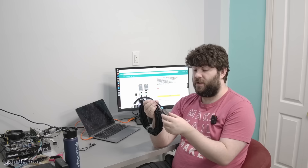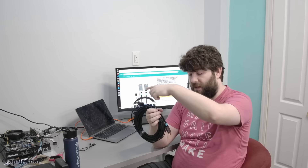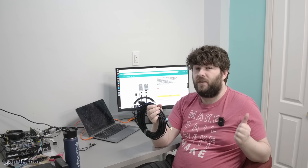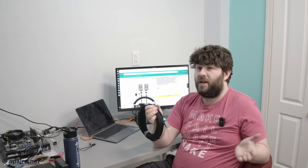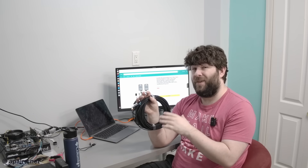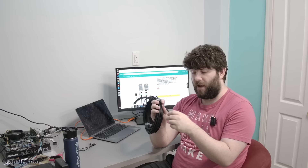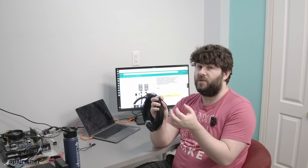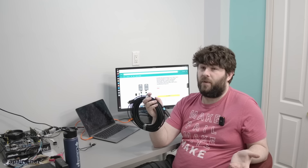Cables like this are basically taking all the signals on the HDMI connector and sending them over lasers to the receiver side, sending some data back — probably 7 fibers total, with 4 carrying high bandwidth data. I couldn't demonstrate eARC or HDMI CEC in this video since I don't have that equipment, but high bandwidth video, standard HDMI audio, and EDID all worked fine. Going forward, I'd love to see a complete line — HDMI, DisplayPort, and USB 3 — all running over MTP fiber. MTP is used for 100 Gigabit Ethernet, so HDMI and DisplayPort are well within its capability.